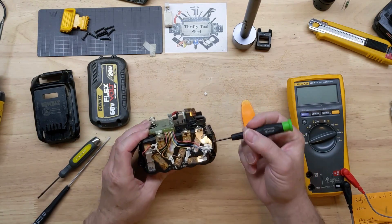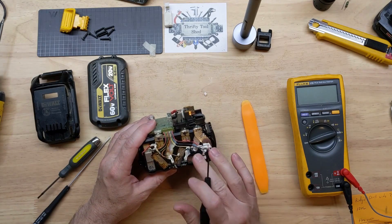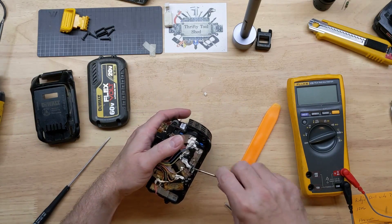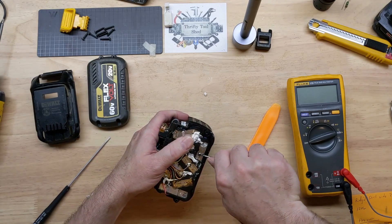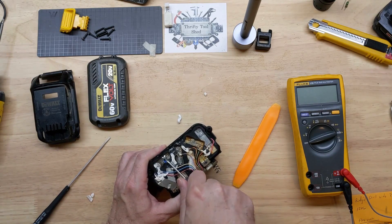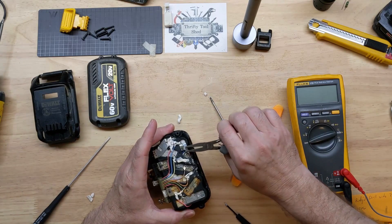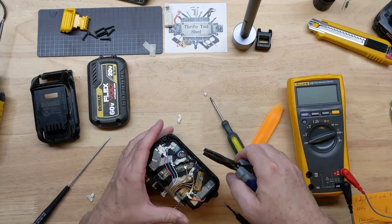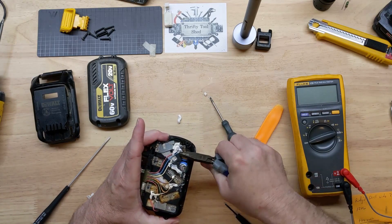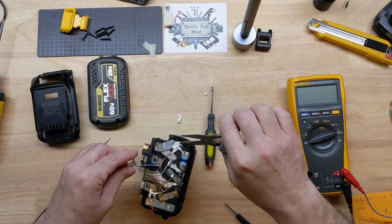Sometimes we don't have the power we need with plastic or non-conductive tools to get in here and pry — we just have to be very careful. Some of these cells, the battery is still charged up to a pretty high level and we don't want for any reason to come across any of these. Another thing to be mindful of is where these metal edges are, and the way these break they're always going to be sharp, so be extremely careful. It's hard to do with gloves on, but these things can absolutely rip you open.